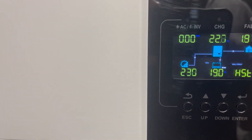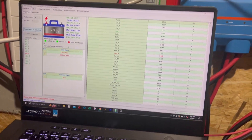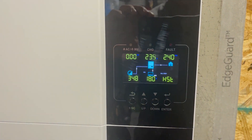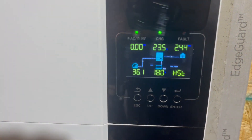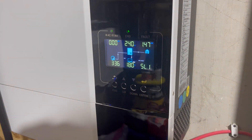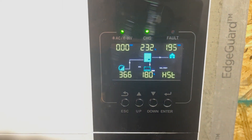It's 8:30 in the morning, sun hasn't really come out yet — still a little cloudy, only 220 watts coming in on one side and about 200 on the other. This thing still is not working even with the firmware update. I disconnected the BMS cable from the computer and it's still showing 18% — I'm wondering if it's going to jump back up to 70% or stay here. Even after the firmware update it's not right. I think when I hooked the BMS cable to the PC it somehow got the system working temporarily — I just don't know why.